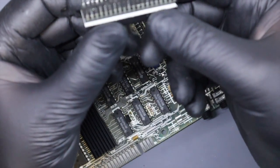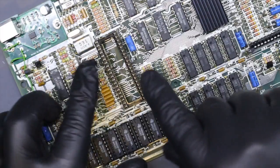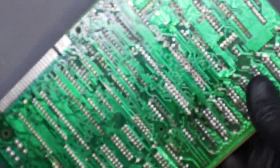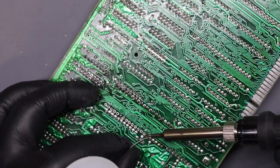The ULA is out and I'm going to keep this one safe, ready for the next one that needs a heart transplant. The 40-pin socket goes in and I'm using the flat-pin cheaper-style socket here, not the turn-pin style, as the instructions for the VLA do mention a turn-pin socket won't quite allow the VLA to sit and make good contact.